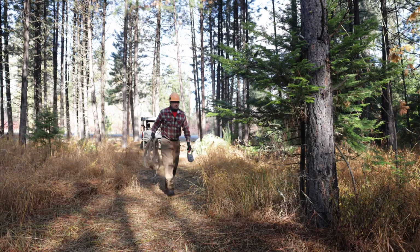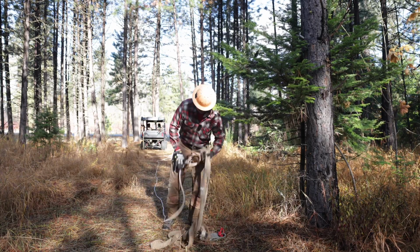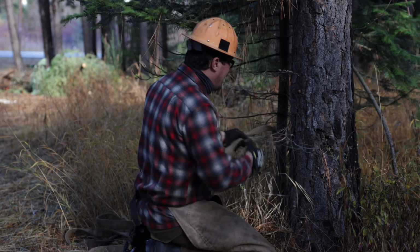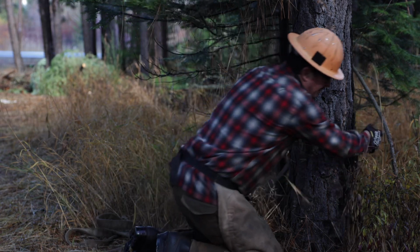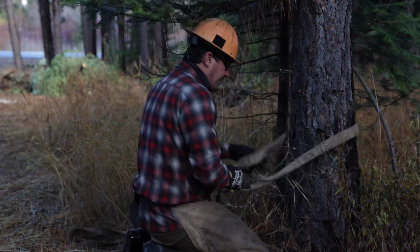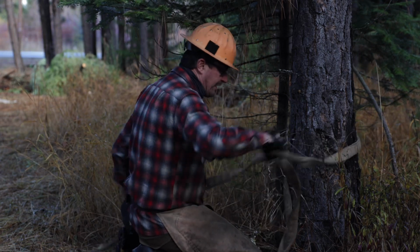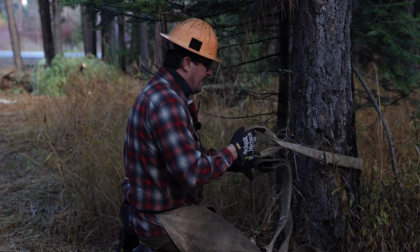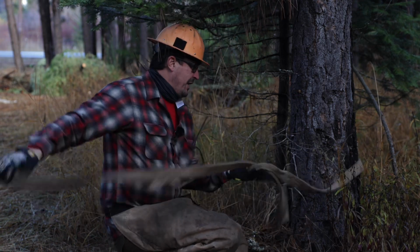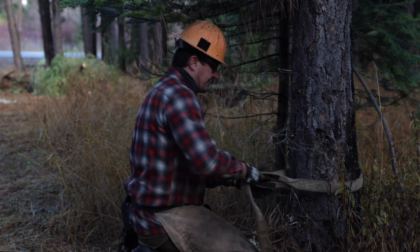And this little tree strap here is gonna help us to do just that. You can get great deals on these old rigging straps from eBay. There's rigging companies that have to have everything certified. So if it doesn't pass because it's got a little abrasion or something in it, they can't use it. And they usually give them away or sell them on eBay. So for this sort of thing, where it's not life safety, you're not lifting items over top of guys, then it's just fine.